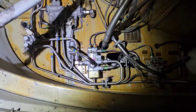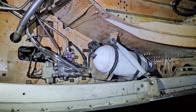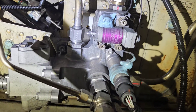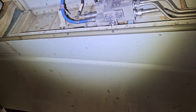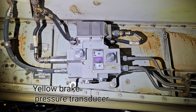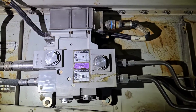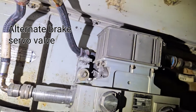All components that were part of the hydromechanical control were removed, and this is most visible in the wheel well bay. What remains is the alternate brake manifold with a pressure transducer sending information not only to the triple gauge indicator but also to the ABCU and BCU. Instead of the alternate brake dual distribution valve, we now have alternate brake manifolds installed in both wing shroud boxes. On each manifold there is a yellow brake pressure transducer sending pressure information to the BCU and ABCU, and the function of the dual distribution valve is taken over by an alternate servo valve receiving inputs from the ABCU.